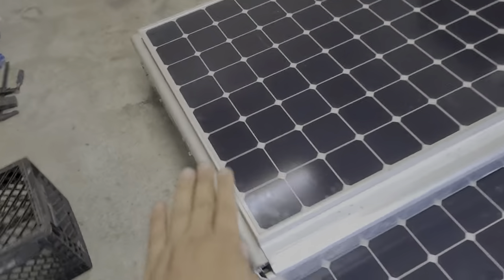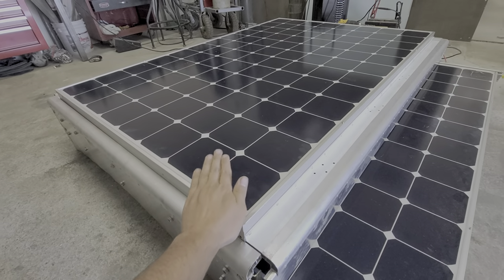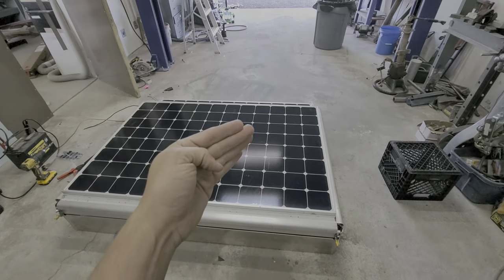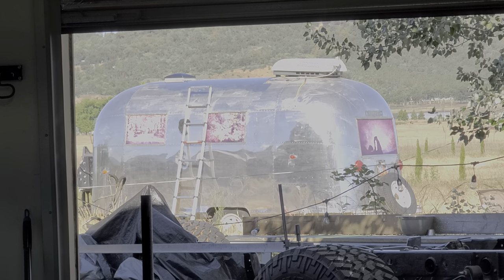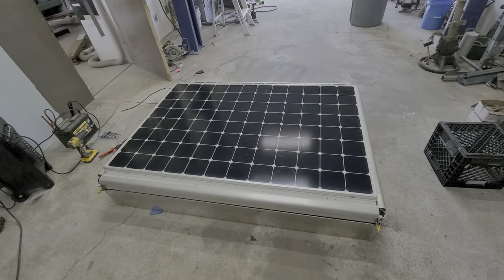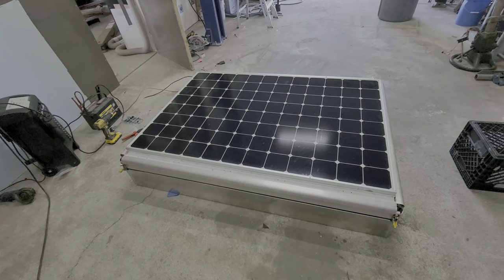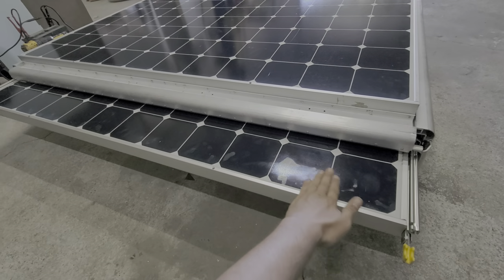Let's give you a rundown. There is a panel on top, and it's just going to sit there — it's going to be fixed. The point is that it will always have sun on it. It should be to the top of the air conditioner, a little bit lower, so we're not adding extra height and there will be no shade from the air conditioner or the fan. It's a 310-watt panel — I've been seeing 280 to 290 out of it, a little less in winter months. There's another panel on this side, a little bit higher.